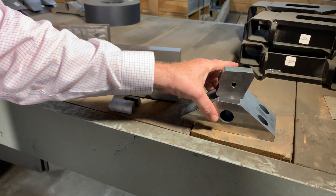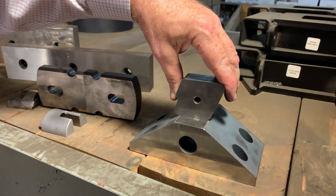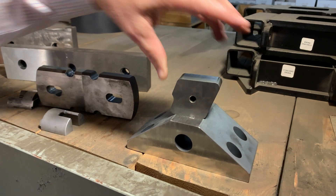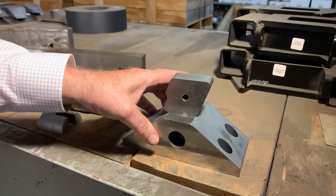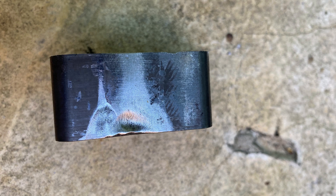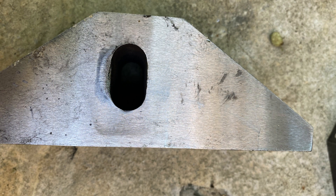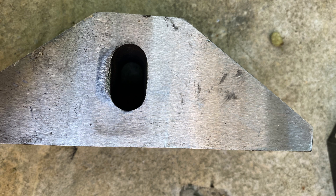I've seen shear arms break because blades are not being changed correctly, and that can run into multiple thousands of dollars in repair costs. Keep your blades fresh and clean. Please examine them before every shift, and if you see anything that's suspect — when in doubt, change it out. Worn blades will show pitting, edges that are not sharp or clean, and often partial half moon or quarter moon cuts. Absolutely time to replace those — if you don't, you're going to cause yourself more trouble, more downtime, and more expense in the long run.